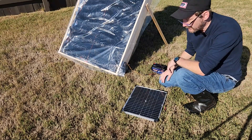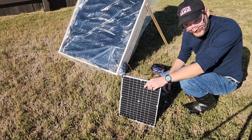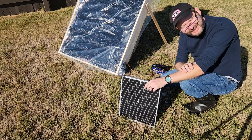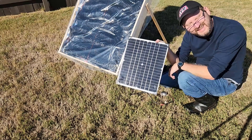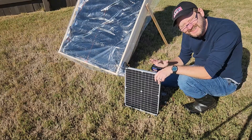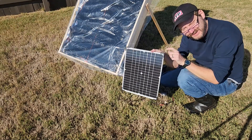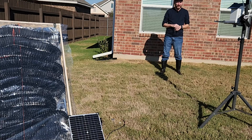I'm using a small lithium ion battery just for testing purposes, but you absolutely could run this on solar. Since you have to have a clear sky to make it work, a little $20 solar panel would easily run this. This fan draws about 100 to 150 milliamps, so that would be more than enough.